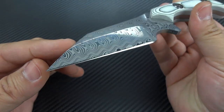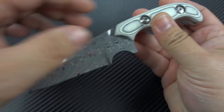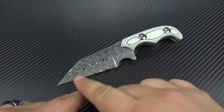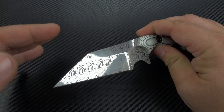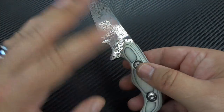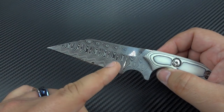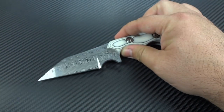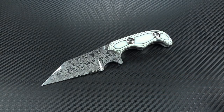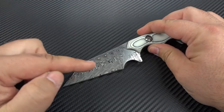The most difficult thing about Damasteel — and this is the very first Damasteel knife I've done, and why I won't do a lot of them — is that you have to do a certain degree of prep. This knife has at least six hours' worth of hand polishing to get it to this level. I ground each of the four bevels through a full belt progression: 60 grit pre-heat treat, 120, 220, 400, 600, 800, 30 micron, 15 micron, 9 micron — all of those individual belt progressions for each of the four bevels.